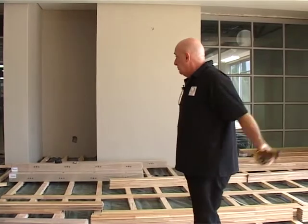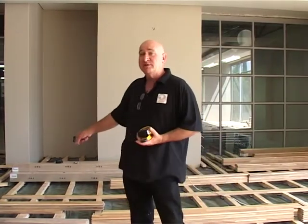Today we're at Planet Fitness. We're installing the sports floor. As you'll see just now when the camera shoots around, it's quite a big floor, longer than your normal 8 meters. You can get away with this in a gym for the simple reason that you have an acclimatized area here. It's fully acclimatized. The humidity, which I've tested, is sitting around 30%. And that means this wood will acclimatize exactly to this area and shouldn't expand and contract once all the air conditions are on all the time. So you can go wider.